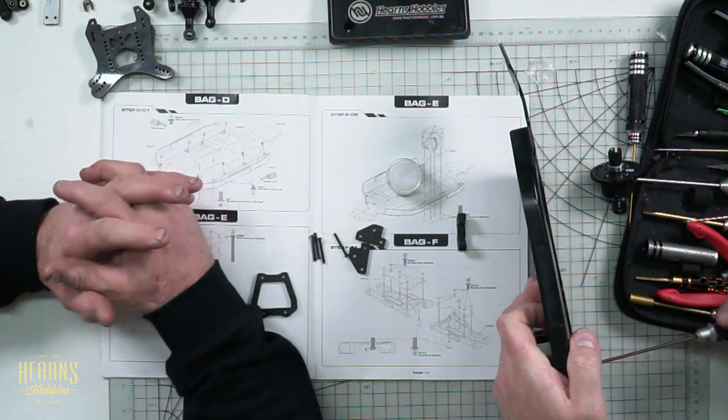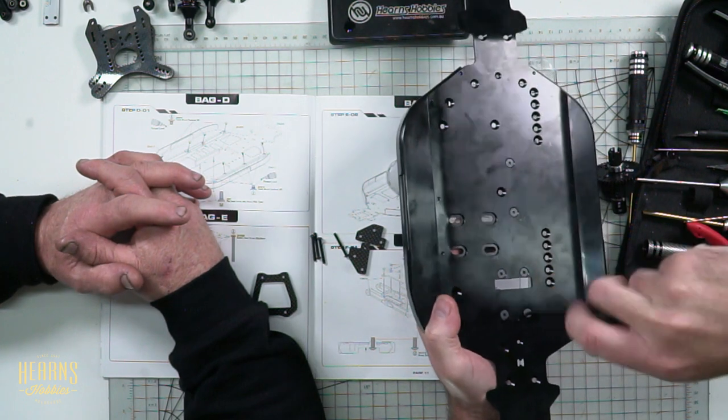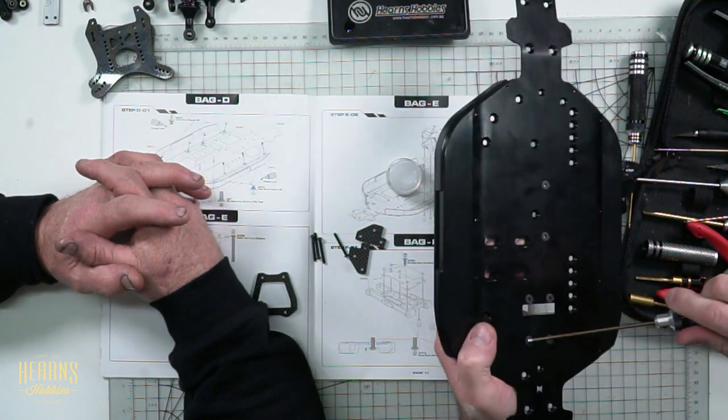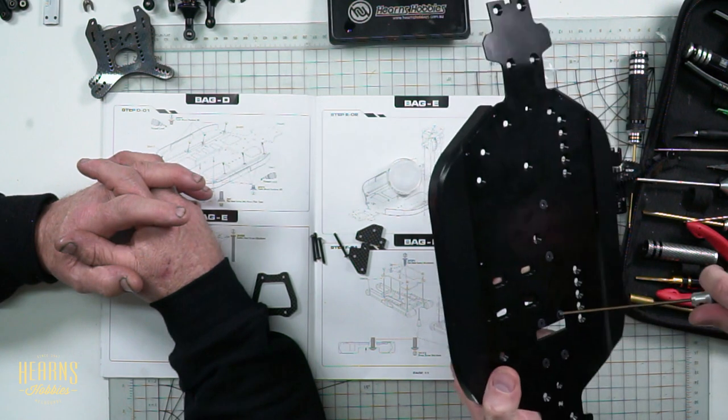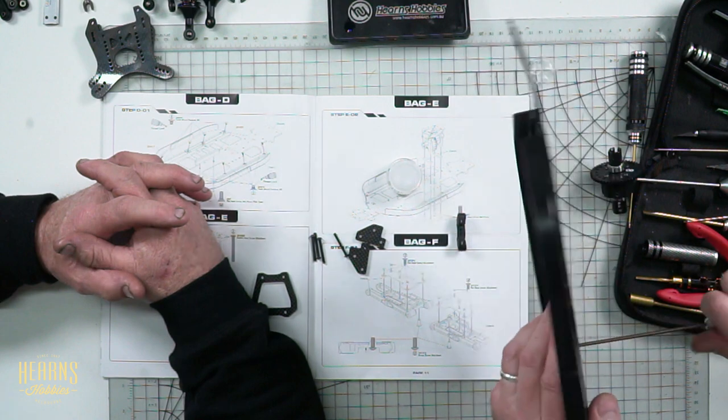That's right. And you can't actually feel when it's getting tight. It's like a false sense. It actually looks like it's screwing into aluminium. Yeah. And it's really nice sharp taps as well. I've had those taps for quite a while, but I've only ever used them on plastics, and they'll last forever if you look after them.